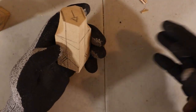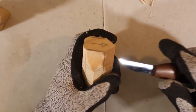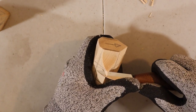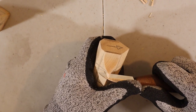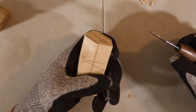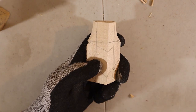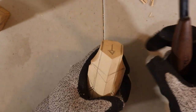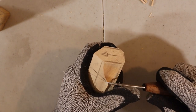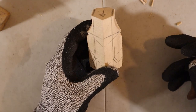I always start with the shoulder, so on about these sides here. I go in a little bit. Don't push too hard because you will pop that wood. So I go there, and then I come back, and then I cut a little V here. You see this little tip going out? That will serve as a stop cut for the next step. And then same thing here. So we have two V cuts.